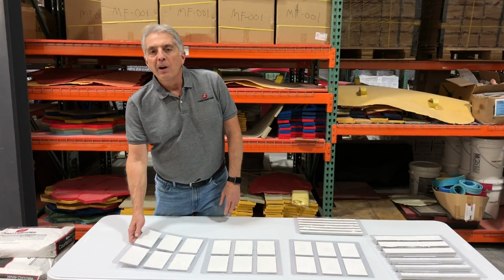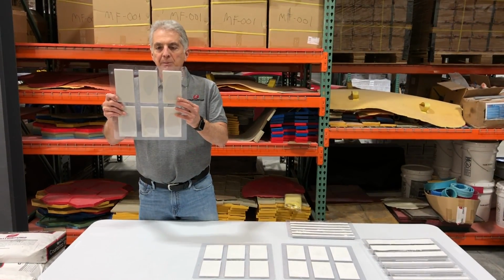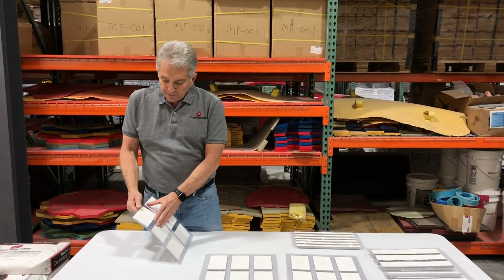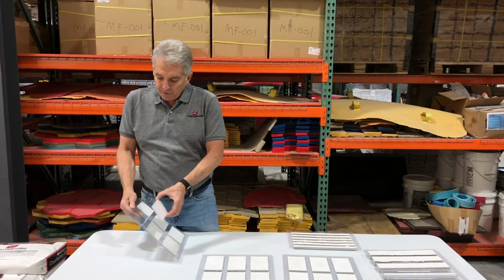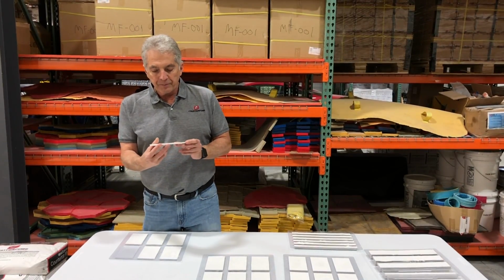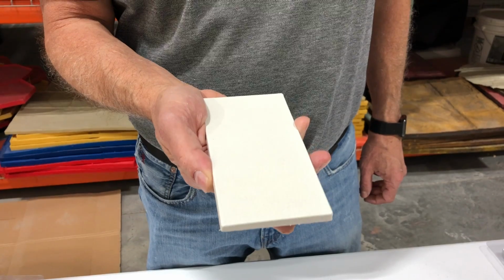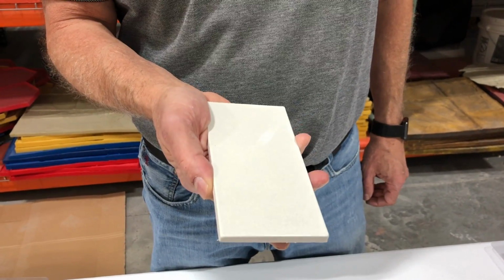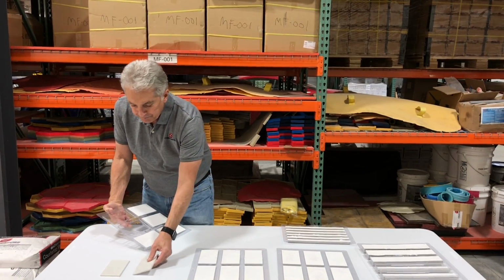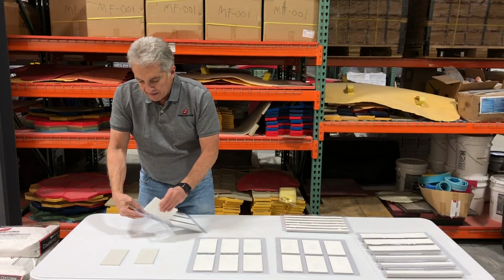So it's 24 hours after we poured the tile. You'll see how from the bottom side what they look like. They're very simple to take out. When you are popping them out, you're going to want to watch you don't damage the form because they are reusable. You see when they pop out, the shine on them, it actually looks like a piece of glazed tile. And they're going to come out really easy. Just push up on the bottom of the form and pull them out.